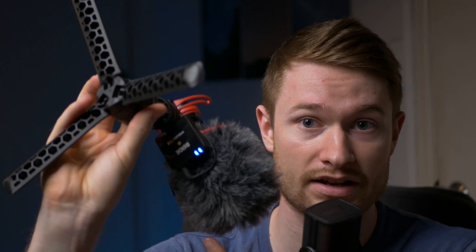The biggest con for the Unify system is you cannot use XLR microphones. I have two XLR microphones I usually use on stream, and if I use this system, this mic would be replacing one of them — that's fine, I'd be okay using a USB and an XLR mic, but I can't even use my shotgun mic plugged into my Rode interface. When they made the software free, you needed a Rode X mic to get all the benefits, but you could still use other Rode mics with limited functionality. Any USB Rode mics work fine as a USB input on Unify, but XLR just isn't going to happen.